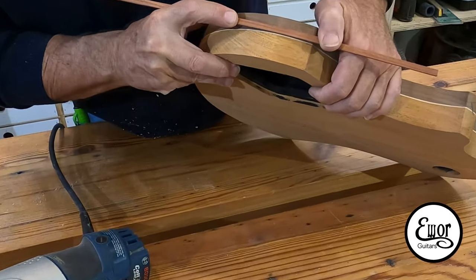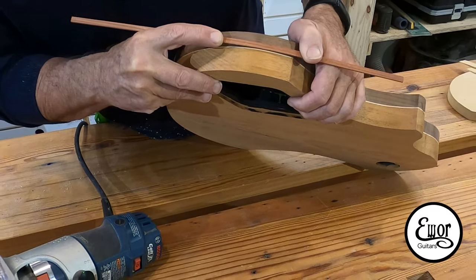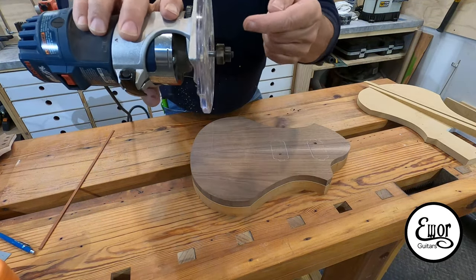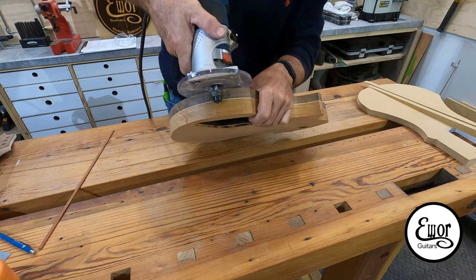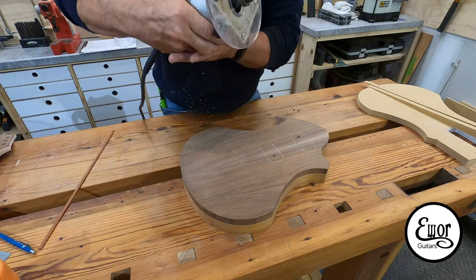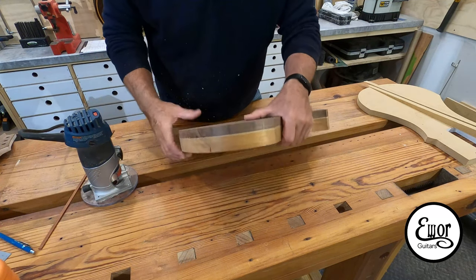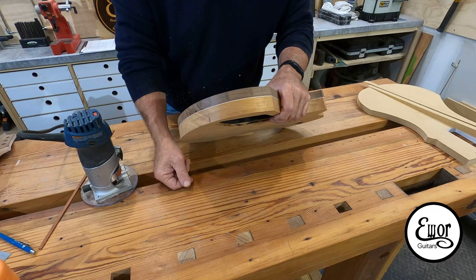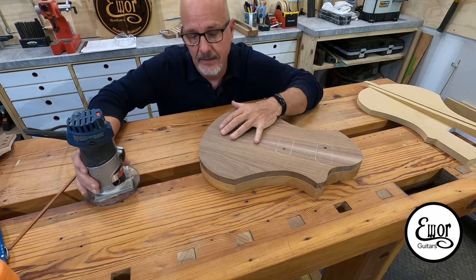My goal is — if you remember from the earlier videos — I want to cut this binding so it lays just on top of that maple laminate I have in there, and I think that'll look really cool. So I have to set the bottom of my router bit so it's going to sit right on top of that piece of maple. Now this bit is going to cut higher than the quarter inch that my binding is, but that's not really going to matter because once that's routed out, we're actually going to remove the rest of this top above the quarter inch of binding. So this is going to cut a wider channel now, but by the time we get this body contoured on top, it'll be the right width for the binding. I've got to get this guy set up for height right here.